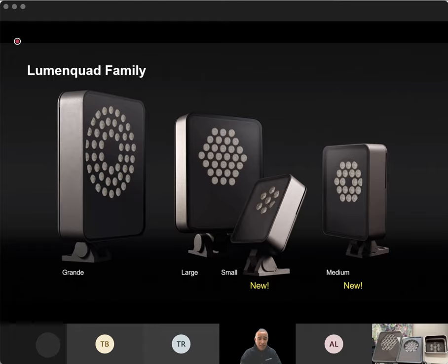It's got that square form factor, nice and sleek. We launched the grande and the large about a year and a half to two years ago, and then we just launched the small and the medium — really rounding out that family with the same approach we have with the beam family. We're now offering the small, medium, large, and grande. The small ranges from 1,300 lumens or 75,000 candelas; the medium up to 2,500 lumens and 150,000 candelas; the large at 5,100 lumens up to 300,000 candelas; and the grande around 11,000 lumens up to 600,000 candelas. Keeping with that family approach, we've got the right fixture for the right application — not to over-design, not to under-design.